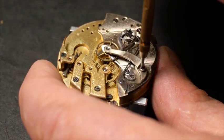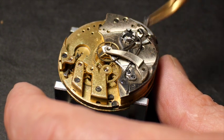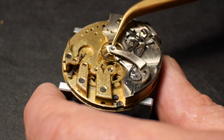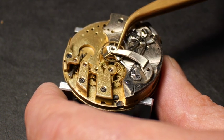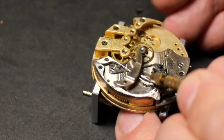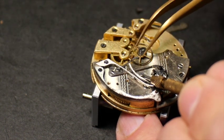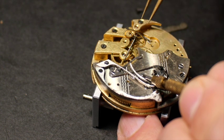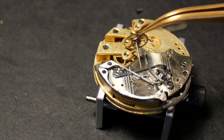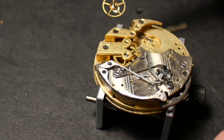Now we can work on this center wheel bridge, which is the third of those really gummed-up wheels. That should just come off the pivot. The whole thing comes off easily, and then that center wheel comes out like that. That's the center wheel — that's the seconds wheel — and that was one of the wheels they put in when they retrofit this. It went all the way through the movement, and that very tip connected to the seconds wheel of the stopwatch.